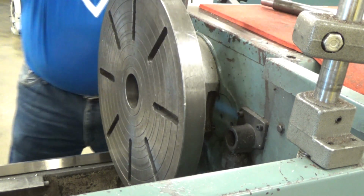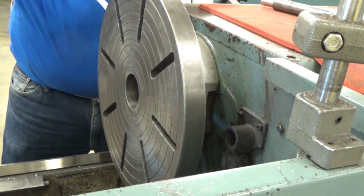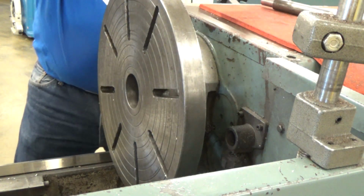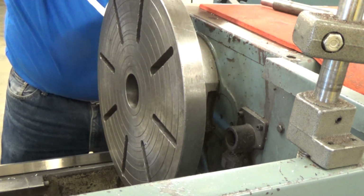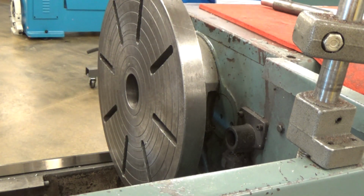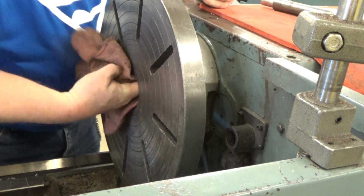And then in the cart that each one of these lathes has, each one has their own cart with their own chuck and faceplate and other multiple tool holders. Each one of the carts is numbered so it identifies with the lathe as well. In there you've got an adapter and a dead center. Dead center means it doesn't spin, it moves at the same RPM.